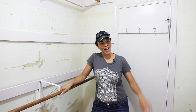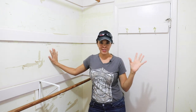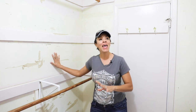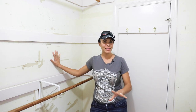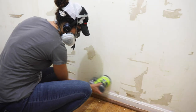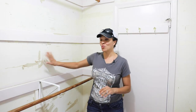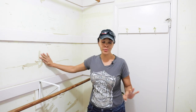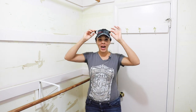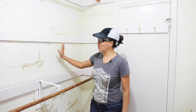It is day two and a half of this closet makeover. We have removed wallpaper, let the walls thoroughly dry, removed all the glue, and now they're actually feeling smooth — we can't feel any of the glue. Now we are ready to sand. We could use a drywall sander, but I really like using an orbital sander. It does create a lot of dust, so you want a dust mask. It's going to help smooth out all these brown patches and any place that feels rough on the wall — we want those spots nice and smooth because then we're going to skim coat.